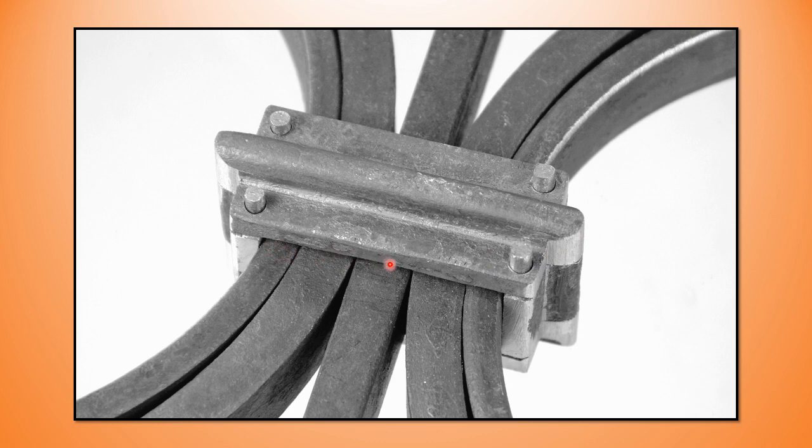I have 1 3/4 inches, I said, for my material to be collared. The back strap is 1/4 inch, the bead is 1/4 inch total from back of the back strap, top of the bead, 1/2 inch, so I need 1 3/4 inches plus 1/2 inch plus 1/2 inch. That's a little tight for me to feel comfortable, so I add another 1/8 inch, and now I can go to work.